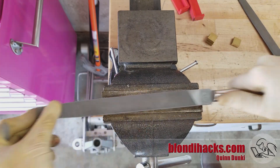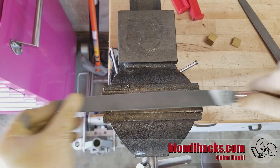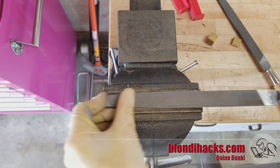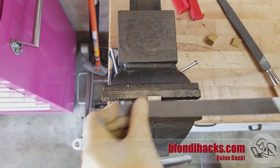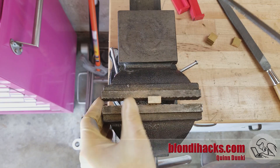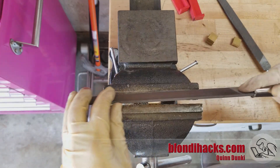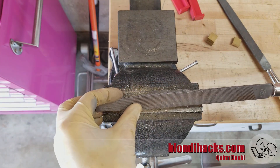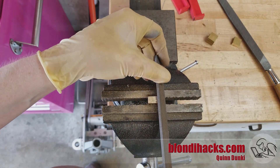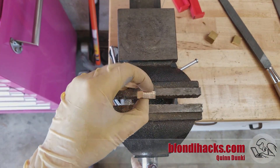I do that more and more these days for brass — it's actually really satisfying. The rough work is done with a 10 inch double cut bastard file, and then we'll grab the 10 inch mill file for cleanup. That fine cut mill file leaves a really beautiful finish on the brass — it's glassy smooth when you're done. And then we'll just knock those corners off as well, just to make it really nice to the touch. All right, then we do the same on the other side, and we've got three more of those to go.